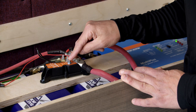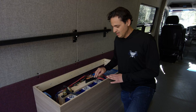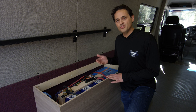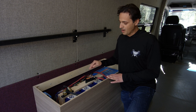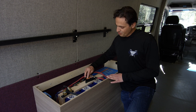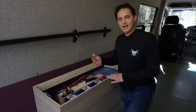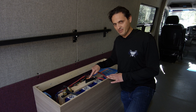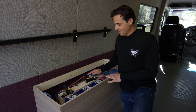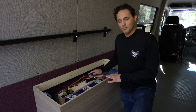If you ground the ignition pin, it's going to raise that threshold voltage up to 12.2 volts. So if you want to use this with a lead-acid battery or something else, you can change that threshold voltage — you can either operate at an 11.5 or a 12.2-volt cutoff. The device name is the BGA225, and that '225' references the maximum current the device can handle, which is 225 amps. If you have any questions about the BGA225 Battery Guardian, please call in at Battle Born Batteries and we'll be happy to help.